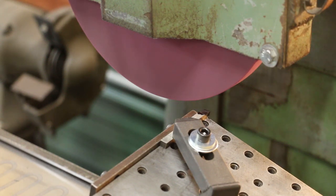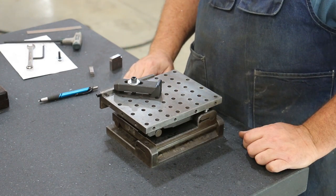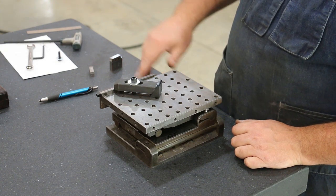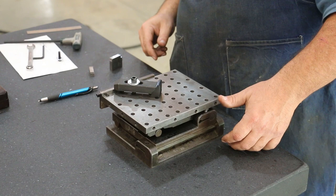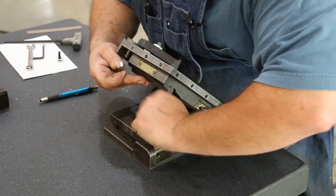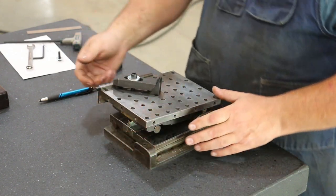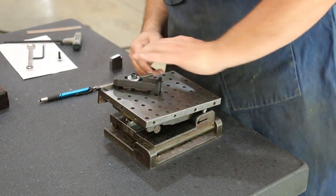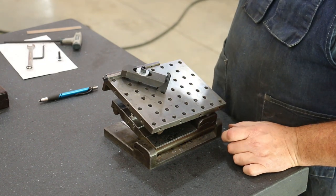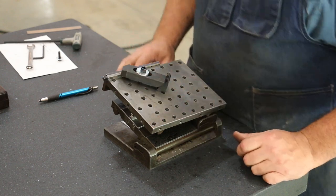That's probably good for that side. I'm going to flip it around and get the other side set up now. Back over at the surface plate, I had to do some reconfiguring of the sine plate to get the angles right for the next side. We're doing the same angles, but because of the way this thing tilts, I had to rotate it and set it up on a different corner. The top needs to face at five degrees in that direction, so I lift it up, clean the surfaces, place the gauge block stack, and the fifteen-degree stack goes on the other side for relief. I'll tighten all the hinges and take it to the surface grinder.